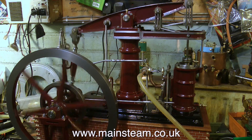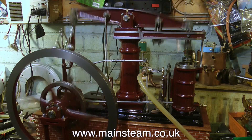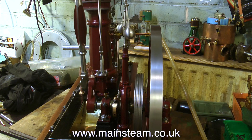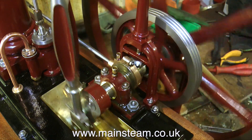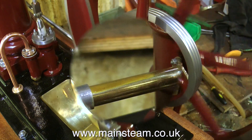I've been running this now for a couple of days, and it's starting to free off. Eventually, as it runs in, it will get very free running. It's not doing too badly now. I could get the engine to go slower than this, but I'd have to cheat, and I'm not going to do that. All of the bearings are as tight as they're supposed to be — no slop in any of the bearings, and the engine feels quite firm when you turn it over by hand.